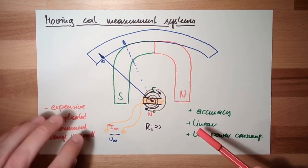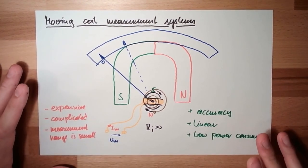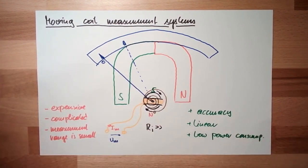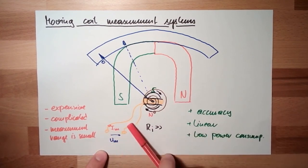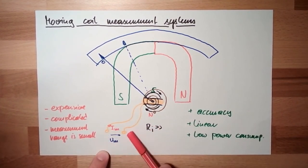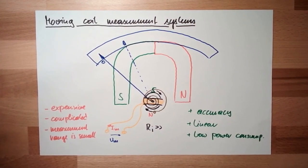All in all, this was the base, let's say, of very accurate and expensive measurement devices. Also multimeters, where you can switch through different measurement ranges and so on. Then you just have selected the pre-circuit here. That's it for the moving coil measurement system. There's another measurement system also working with a pointer on a scale and so on. This is called moving iron. How these moving iron measurement systems are working and how they are built up, we will see in the next video.